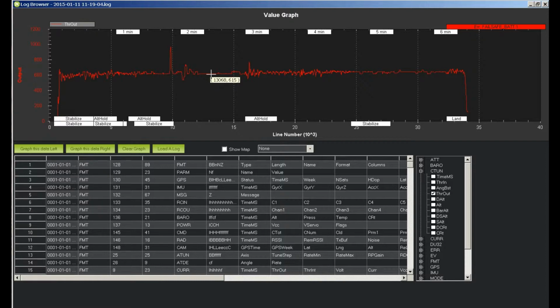So when you first come out of stabilize mode at 50% throttle, and it's a mark on the RC transmitter that I keep it at, you want the platform basically to hover. You don't want it zooming up, you don't want it zooming down. When you come out of those modes into stabilize mode, very little changes in throttle are going to make very big changes in altitude. Whereas while you're in altitude hold or loiter, this parameter is going to affect the fact that if you move that throttle radically, it's not going to let the platform move radically.